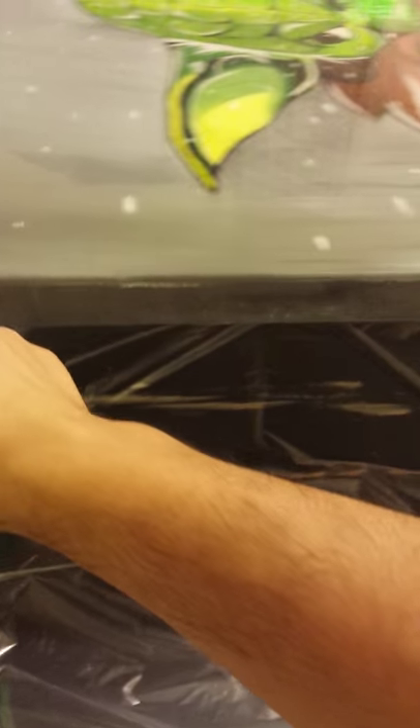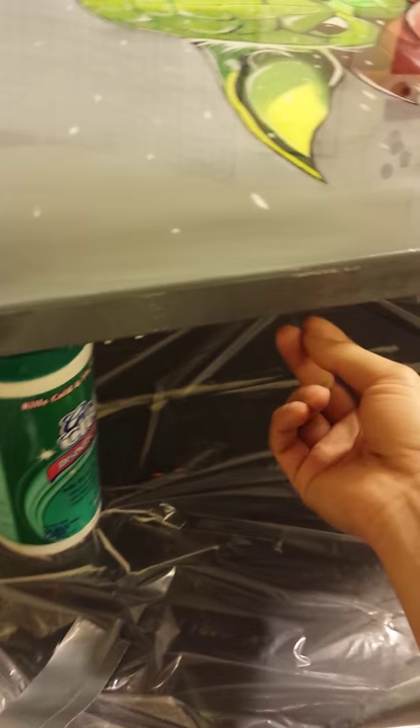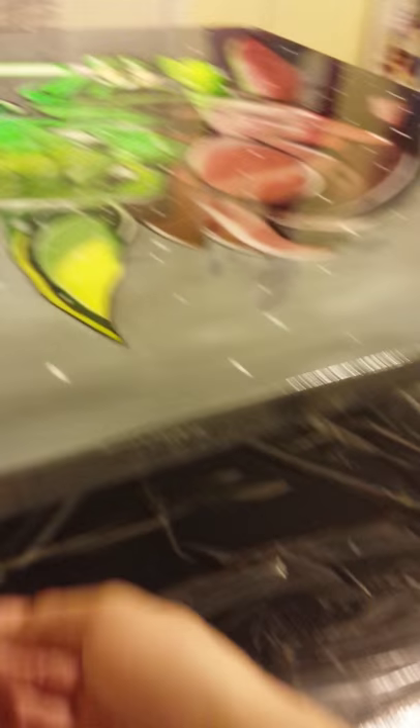Don't forget to use plastic gloves — you can get those at Walmart. This will all start dripping down from the edges when you're done spreading. Do not touch anything on here — leave it alone. It might start looking like it's got a smudge or a blotchy spot, but this is all going to level itself out. Then it's going to start dripping over the edges — use your gloved hand to spread a nice layer to the sides as well. Don't neglect the sides.